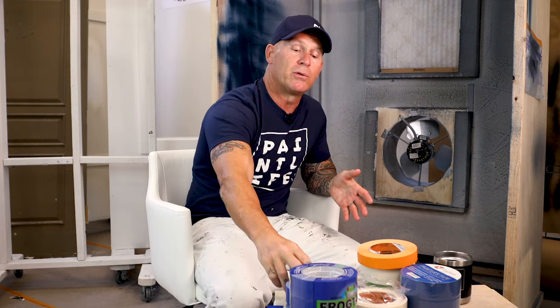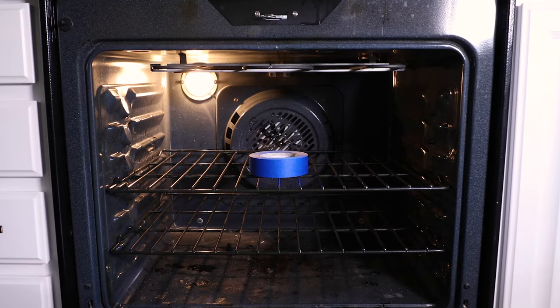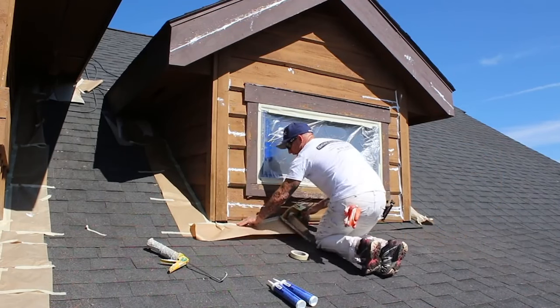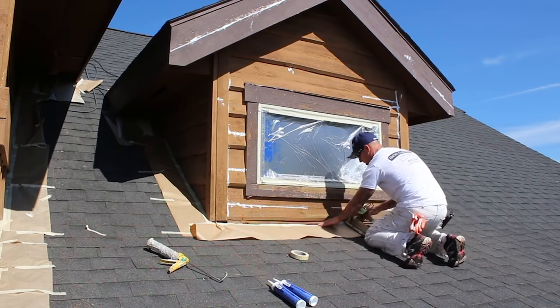Another quality of blue tape is that it's more heat resistant. Some of the blue tapes I researched are heat resistant up to 200 degrees for 30 minutes. On top of a house, it can be 150 degrees, and the ambient temperature of a surface where you're masking can be even hotter than that. The heat resistance makes it so the adhesive doesn't dry, the paper doesn't fail, and you can still pull it off really easily. The heat resistance on some production tapes is significantly less, which means masking onto roofs or hot surfaces — like a bronze anodized window getting 150-200 degrees — the adhesive is going to dry, and when you pull it off it's going to leave adhesive behind.